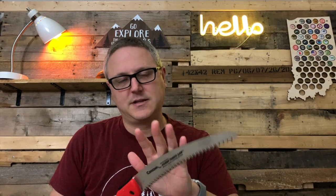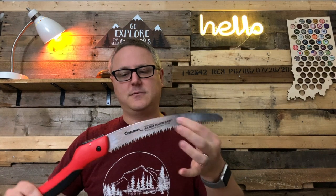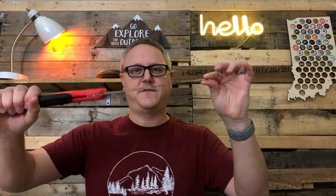The reason that's important is a lot of saws — not necessarily folding saws, but saws in general — are push-type saws in America. Overseas, I've heard there are a lot more pull-type saws. With pull-type saws, you can make a much deeper cut with less effort, and you also have less force going into the blade. With a folding saw like this, as you're pushing you have less control and there's more likelihood that you'll bend your blade — and I've actually had that happen.